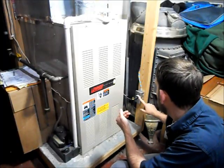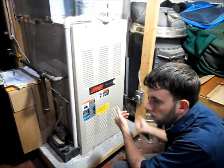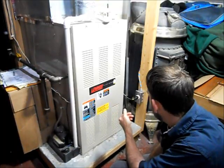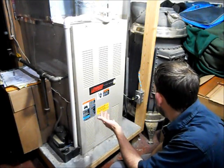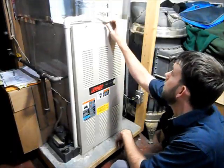That's why we use a single outlet rather than a duplex — in theory, somebody else could plug something in here like a sump pump and overload the circuit. So that's what we've got.